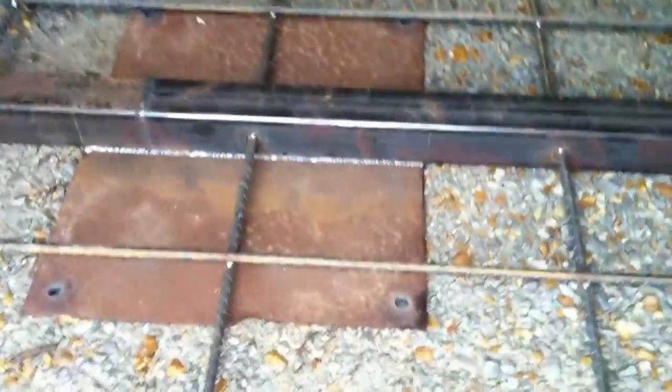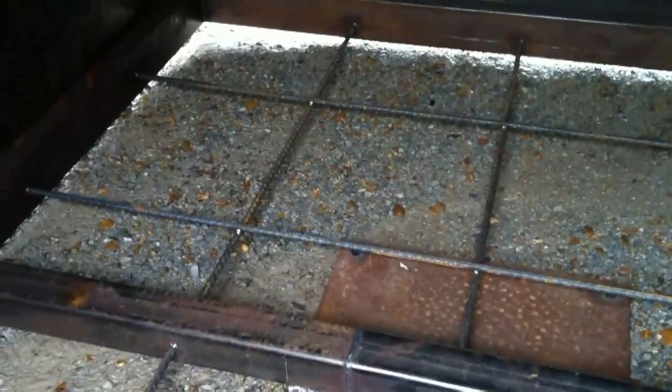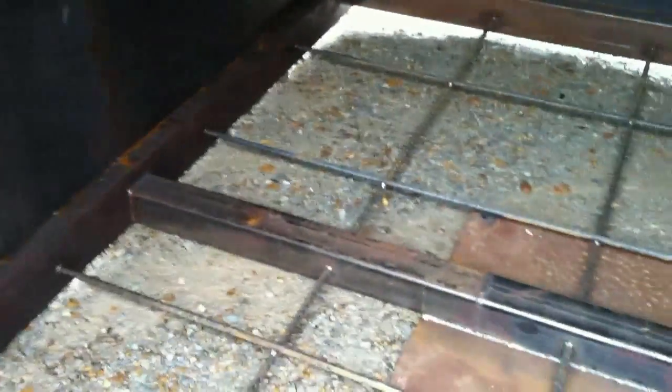Then we have some other rebar that we fabricated up that goes in those holes, and if you excavate a hole out here below this plate — say approximately two to three foot deep, or however deep you want it — you fill all this with concrete at the top of these six-by-three rectangular tubes here. Basically you've got a built-in form on the storm shelter, so the concrete is part of the metal building.